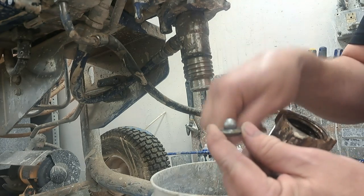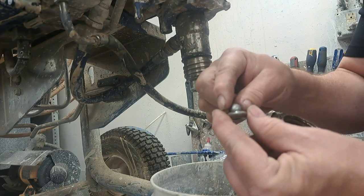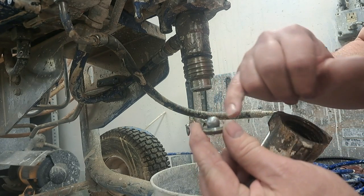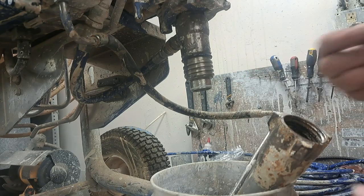The ball stops the material from going back into the bucket. If I stuck my hand at the bottom of the pickup tube while running, I could feel it pushing back. So if this ball is not in good shape — each one of those cuts and grooves you see on it — when it's sitting there it pushes material back down through into the bucket. A bad ball will cause this, and it can occur for a couple of different reasons.